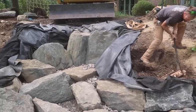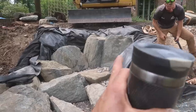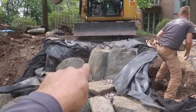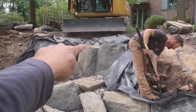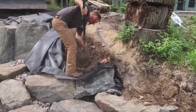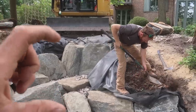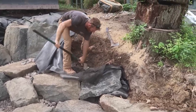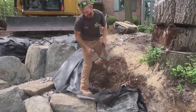We have basically the framework for our waterfalls built. There's a rock we just set this morning that's going to have a nice pitcher-style waterfall fed by another waterfall sitting right back behind this rock at about the same level. Water will split around that high point, come down and dump into the basin below. Nick and I decided to work on retaining stones next, get this all buttoned up, then fold the liner back and dig our next pooling area for about an 18-inch tall waterfall, then start digging the upper pool. Big day — it's Friday for us but work hard, play hard.